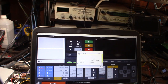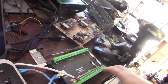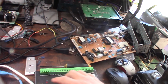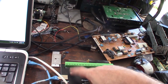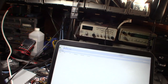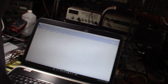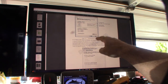Nothing. This is kind of why I test before I put it in the machine - having to rewire my whole machine and take it out again would be terrible. I'm going to use my Advanced IP Scanner to figure out where the device is on the 192.168.1.x network. The manual is confusing because it almost makes you think you could dynamically assign an IP address.